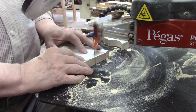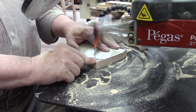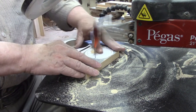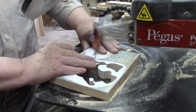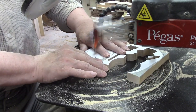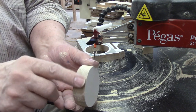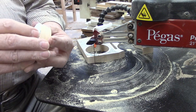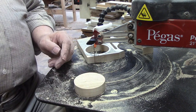Although cutting a circle would seem to be simple, it does take skill to get it as smooth as possible. You need to keep the wood blank turning as smoothly as you can, otherwise you may end up with slight variations that may or may not be noticeable when you're done cutting. You can smooth these out with a little sanding, but it's not easy to sand a perfect circular shape either. It's best to cut the circle as nearly perfect as you can to begin with. There's a little rough spot on the edge of the circular base, and these rough spots almost inevitably appear when you have to start and stop the cut on a curve. I'll have to carefully smooth that out with a piece of sandpaper or a disc sander.